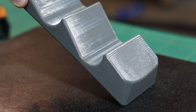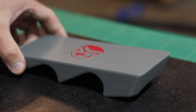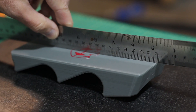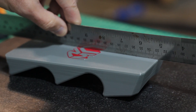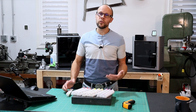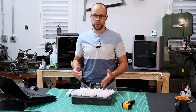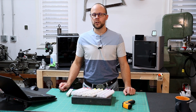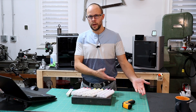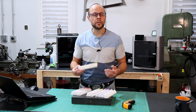I've personally had good success with PETG. When I print it in an open-air environment, the warpage isn't really that noticeable. Some prints with rounded corners have stayed completely flat — when I placed them on my surface plate, I couldn't tell there was any lifting whatsoever. That may not always be the case, because there are so many factors involved: how heavy-duty you're printing, what the part is, how big it is, and bed adhesion. Even the manufacturer and the chemical makeup of that particular filament play a role. If you want to print PLA in an enclosure and reduce warpage, another option is simply to slow down your print — though I have fast printers and don't really want to slow them down.